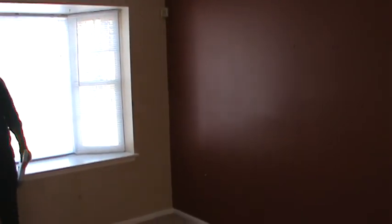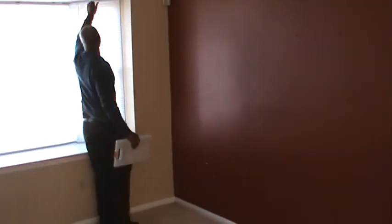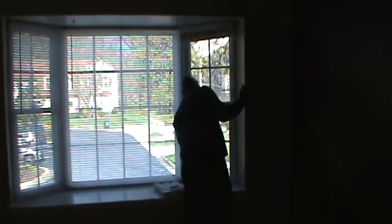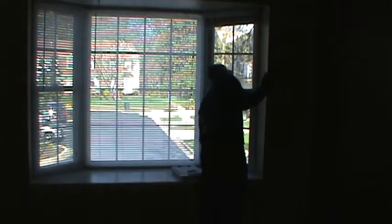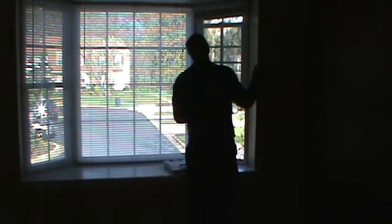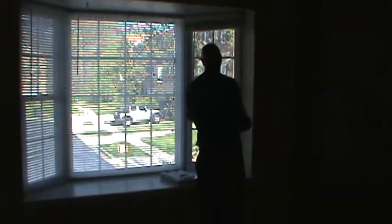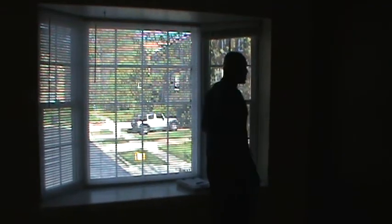There was a leak in this house. That metal roof out there sitting on the bay window, that water just coming straight down the side, messing up that trim. Probably got to replace some flashing and put something in there as well, because that's going to be reoccurring if we don't address it now. Your flashing.